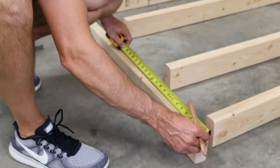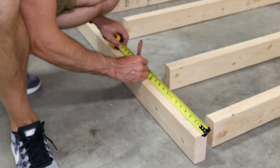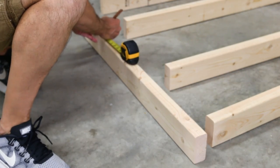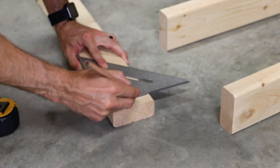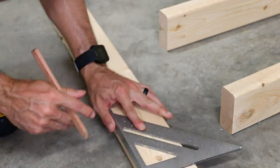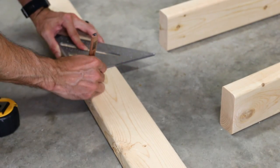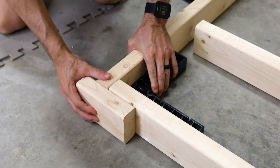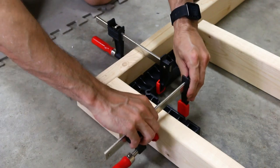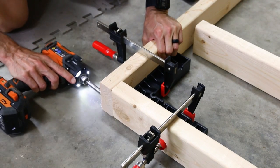As a recovering engineer I'm a big fan of symmetry and precise layouts. So I made marks on the edge where I wanted my screws to be centered on the front and back. Then I grabbed a carpenter square and marked the locations of the screws — an overly thought out process which I love. I started on the near corner and used a scrap block to flush up the outside board with the front. A 90 degree clamping square and a couple of small clamps lined everything up while I drove in my first screws.